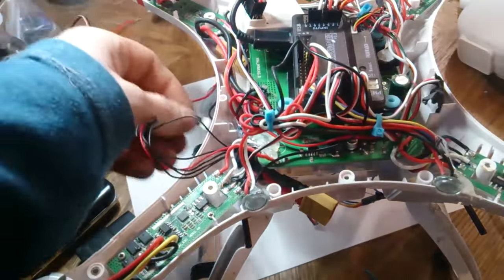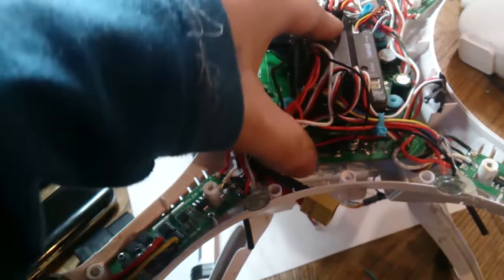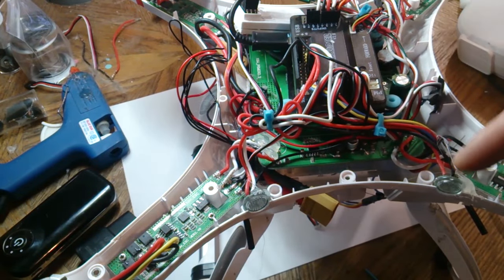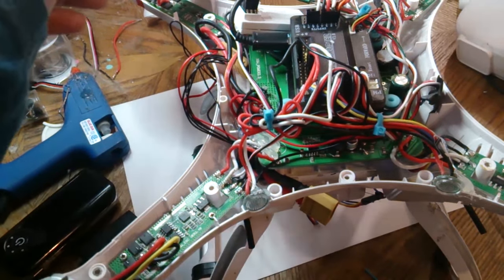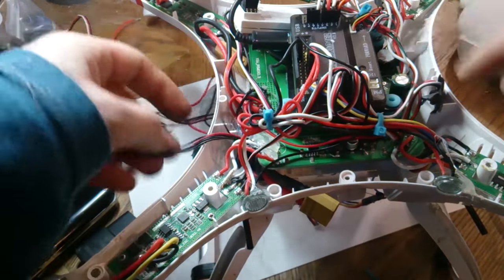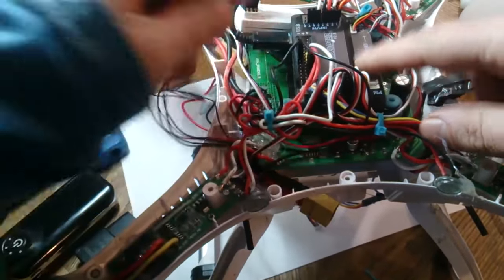This is important because if you don't do this, you run the risk of screwing up your ESCs almost instantly. So it's up to you if you want to take convenience over kind of like safety. It's a gambling game because I have done it originally without doing that, and I've never fried an ESC. But I was helping some guy on my YouTube channel, and he ended up frying one of his ESCs. All right, enough babbling. So take out your power module or take off the power source off the board, either or. The only power this APM should have is from USB.